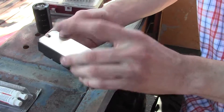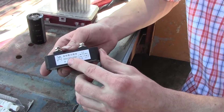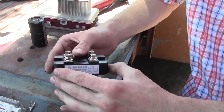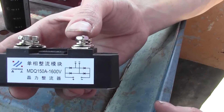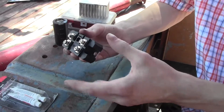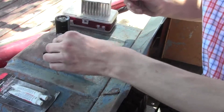For parts you will need, of course, a rectifier. This is a 150 amp — you can also buy a 100 amp. Those are only a couple of dollars cheaper, and I think even though that's a 90 amp welder short circuit, it will probably exceed 100 amps, so I just bought a 150 amp one so I know this will definitely work in all conditions. You can get these shipped to your door for about $15.